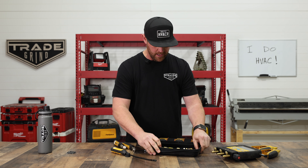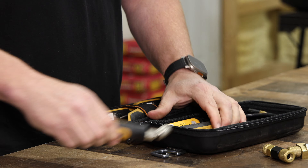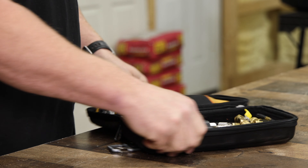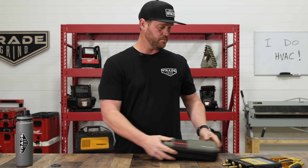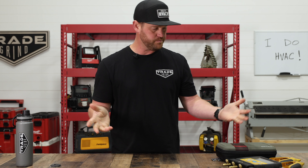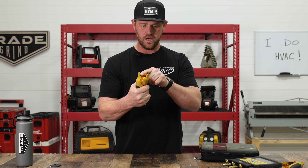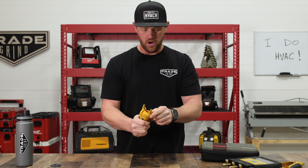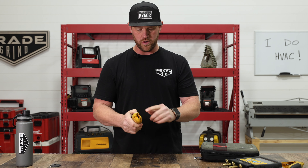Everything lives nicely in this small hard shell case, and it even has a little clip so you can clip it to your belt or tool bag. For the induct psychrometers, I typically drill a 3/8-inch hole wherever I want to insert it. The pipe clamps have a metal contact surface — if you're working on an old system where the pipe is corroded or dirty, you can work it back and forth to clean the pipe enough to get good contact and an accurate measurement. You can also use sanding cloth if you prefer.